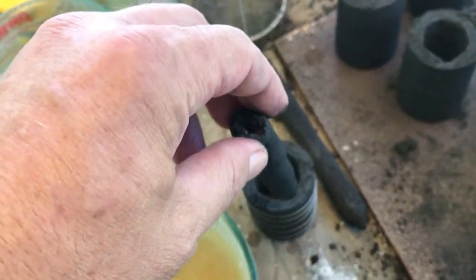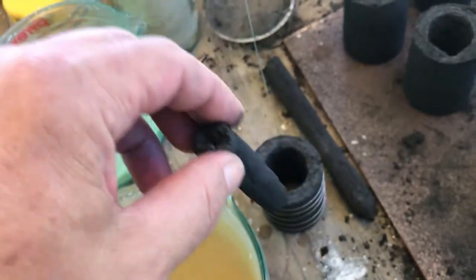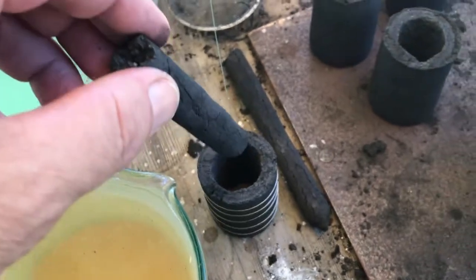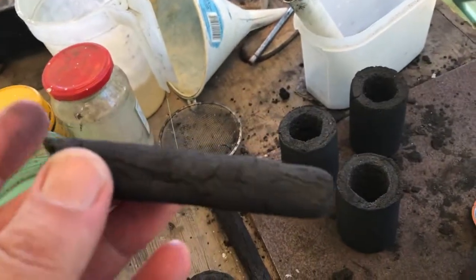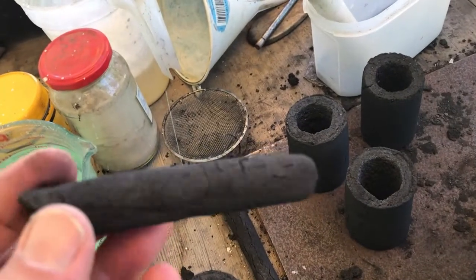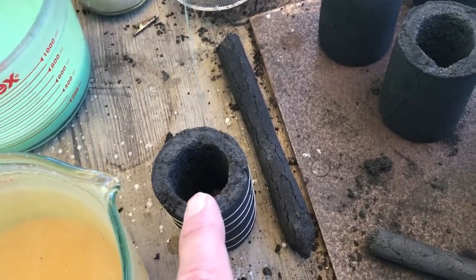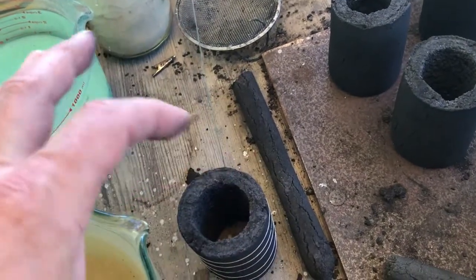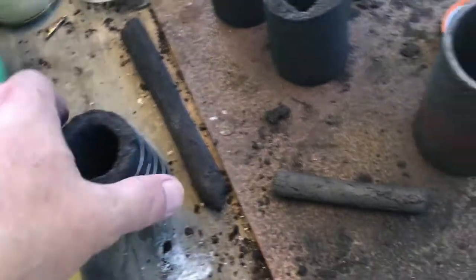And I'm thinking having the larger zinc will be a better cell run, will have more capacity. I'm hoping. If not, doesn't matter. These seem to be a bit fragile. They can sort of just crack off anywhere. So what I might end up doing is making a smaller round one like this, and then a larger outer one, so it will increase the size of the cell but probably be more reliable.